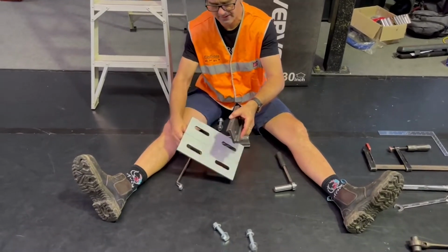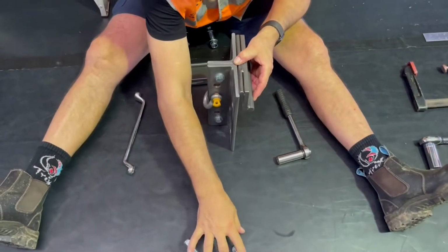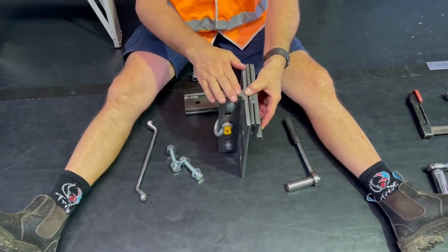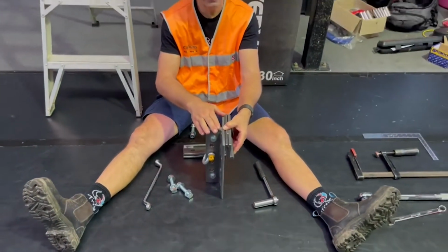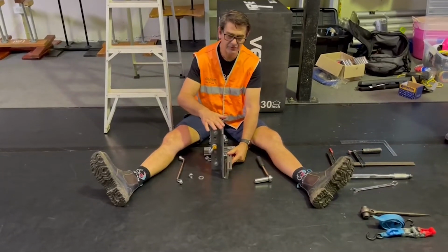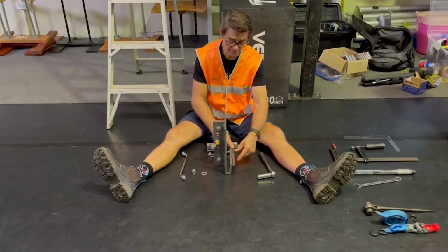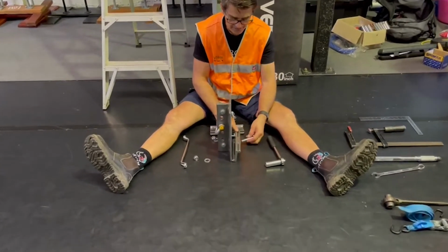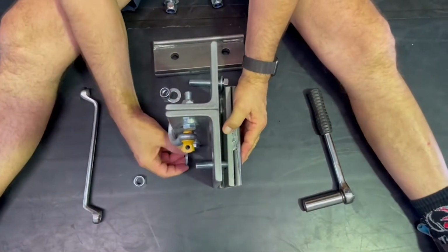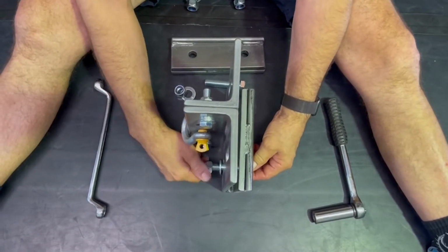The beam clamp will sit like this. It will sit on top of the beam clamp, and we'll attach the 2 bolts and get it prepared so that we can place this on the very first thing we'll do once we get up there. The most convenient way to set this up in the beginning is just to have the top flange on one side on the ground so that the ground is supporting the weight of it, and you start preparing the bolts in place.